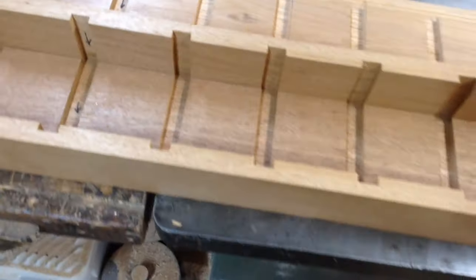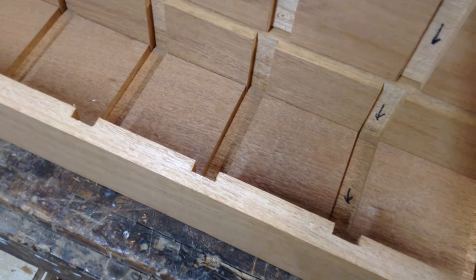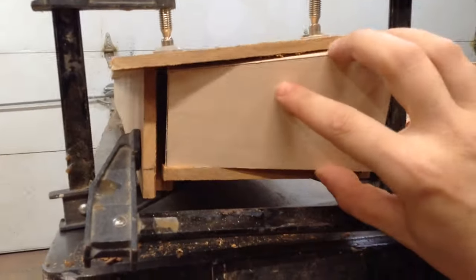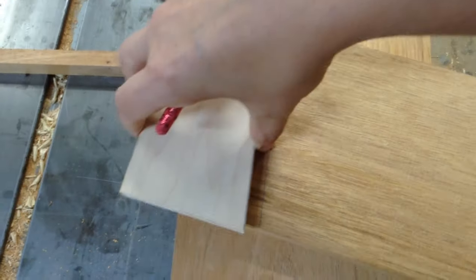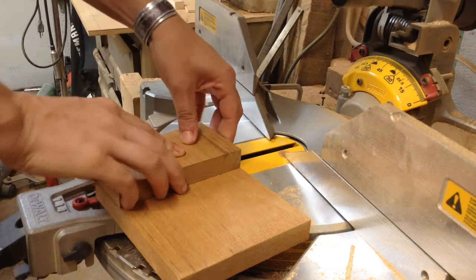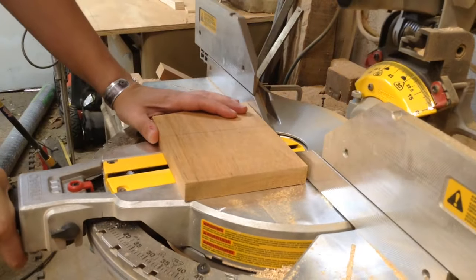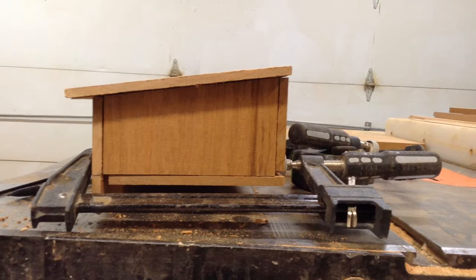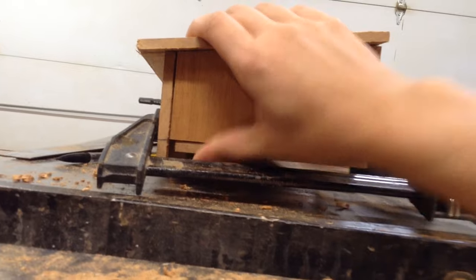Those arrows were just reference marks to make sure everything lines up, and then the top goes in place. The reason I spent all this time doing this is because making this out of solid lumber would have cost twice as much — and it was already quite expensive. Also, even nice-grade lumber will have bows and cups in it; even plywood and MDF, which are considered dimensionally stable, will bow especially over longer spans. The torsion box pulls all those pieces together and keeps them flat. I made a plywood plug for the edge, transferred the marks onto mahogany, and made the exact same cuts on my miter saw.